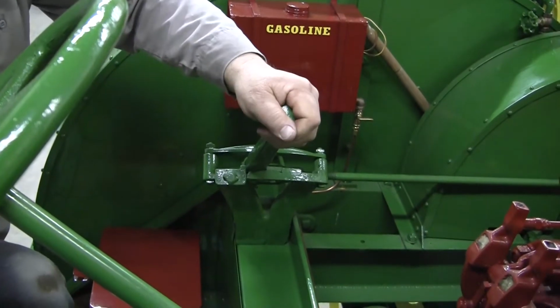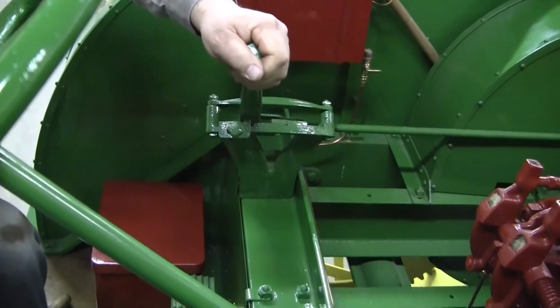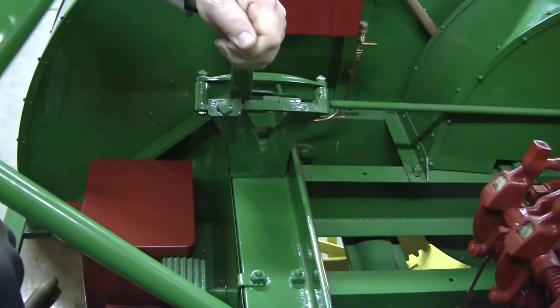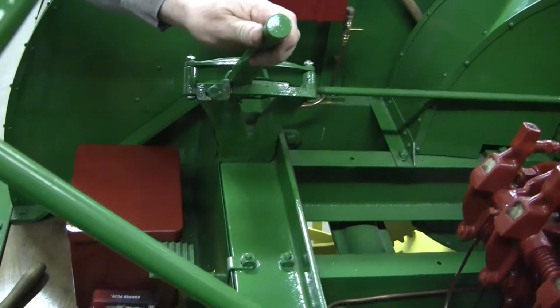And so with reverse, you pick it up out of the dog, pull it back like this, you go here, and you gotta let the clutch pulley up just a little bit until you see the belt pulley just barely turn, and it'll click in. Then you can load up and go. But it's important to have it fully engaged before you go to move it.